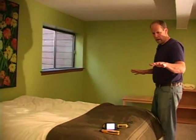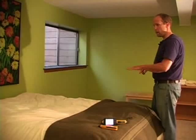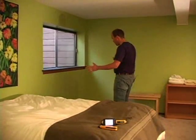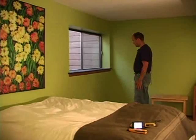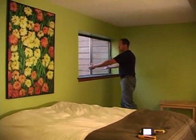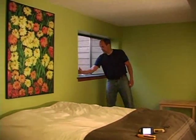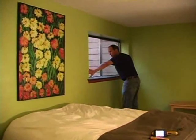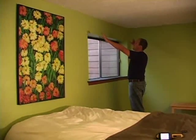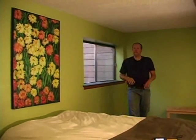The areas I look for are the bottom corners where the baseboards are. I'm looking for watermarks and stains in the carpeting. The window well is a great place for a moisture inspection — there are really three places you want to look. Below the window frame, because if it's not draining properly outside the window well, water will come into the basement. Second place is the bottom corner of the window frame, which sometimes collects water. And third, there could be a flashing problem up at the top where the header is.